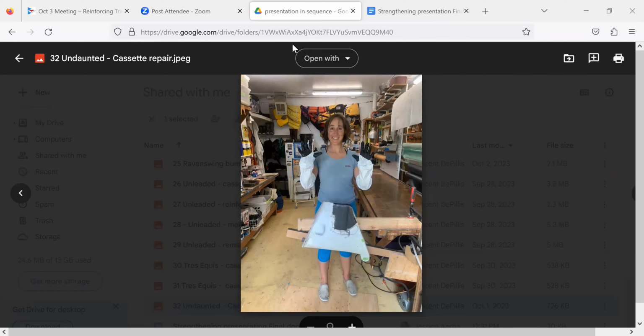I had a Seawind 1600 just a couple of years ago, also known as the Corsair 52, with original cassette rudders with carbon blades. We hit a reef off the channel right off the Florida Keys going about 8.5 knots, both of them. And both the blades swung back and they sliced into the cassette, which was built with sacrificial bolts, but the cassettes never gave way. The bolts actually carved themselves right into the carbon blades and just ripped the carbon blades apart. But I was able to salvage enough between the two of them to create one good rudder. And then we made our way over to the Caribbean. So those bolts in my rudder are sawed halfway through.